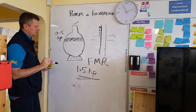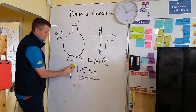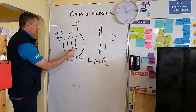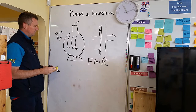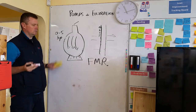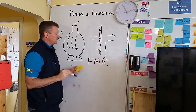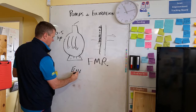Our recommendation has been and always will be an energy efficient pump, because you get the best of both worlds. You can get a lovely low flow rate coming through very gently to filter the water well, but then you can ramp it up to a one or 1.25 horsepower equivalent to give it a really thorough backwash. So you're getting energy savings, great filtration, and a good backwash. The same applies to your cartridge filter — lovely gentle flow so debris is caught on the surface and not forced into the middle, and when it comes to hosing out time it should hose off a lot easier.